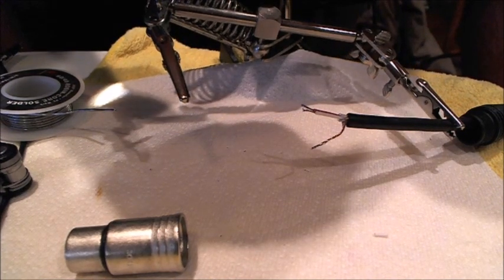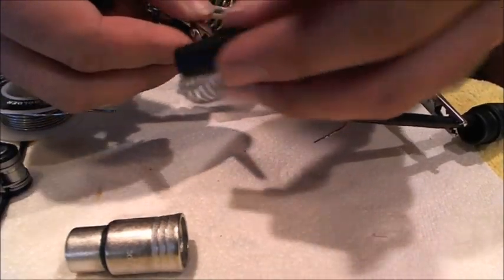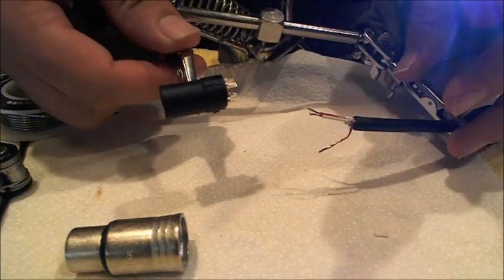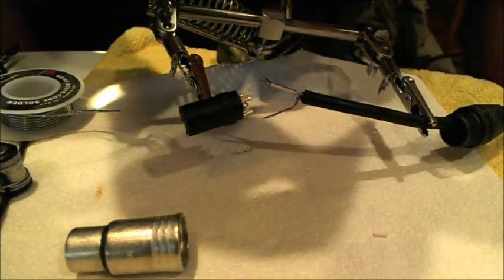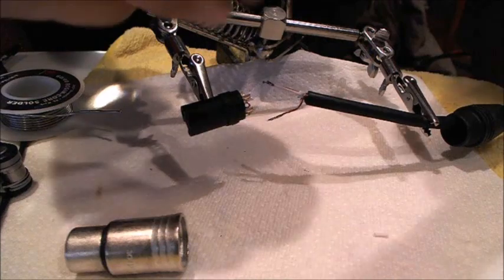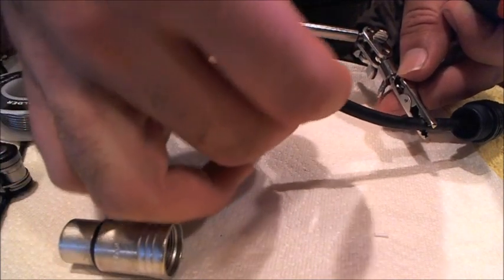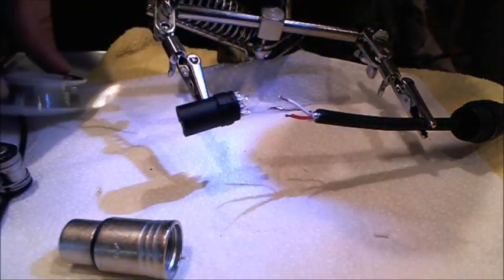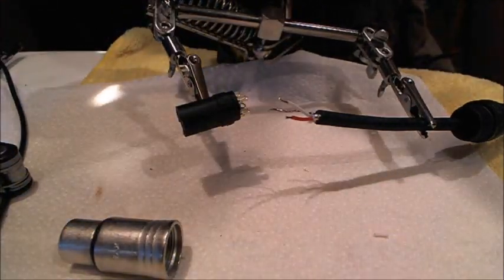Now I'm going to tin each connector on the Neutrik here, and I'm going to kind of reverse the order of the cables as I have them on. There's a little spring on the bottom of this Neutrik that the solder guy can grab onto. I've got to switch the order of these cables around, though, because number one is now closest to me. Number three is always going to be in the middle, and number two is going to be on the other side. Again, I like to organize those cables in the order they're going to be used.